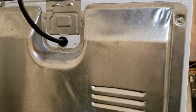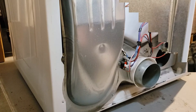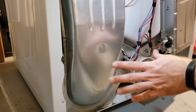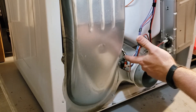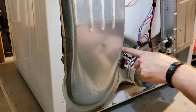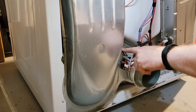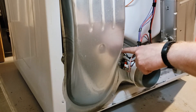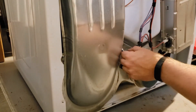There's just a bunch of screws around the perimeter of the back panel that we need to take off. All right, so we're in the back here — I've taken the panel off. Now the first thing I always check is this guy right here. This is called the thermal fuse. I'd say 90% of the time this is the problem, so I'm just going to pull the connector off.